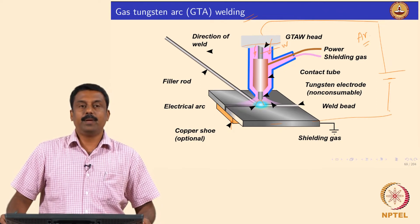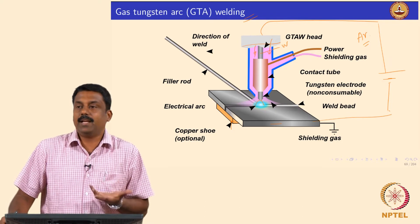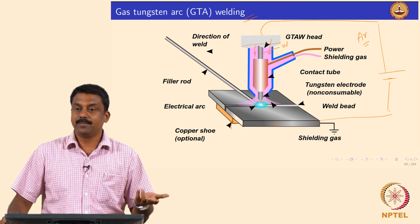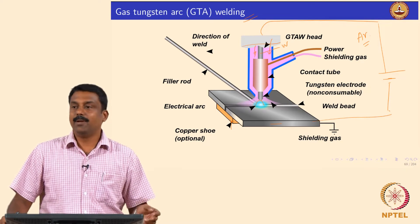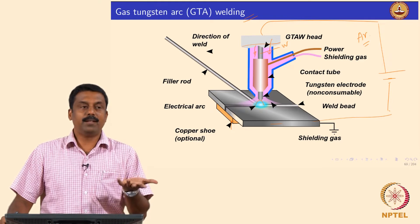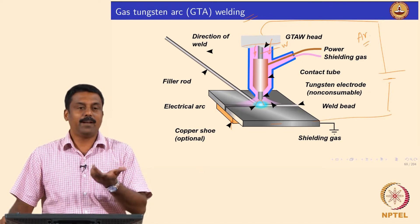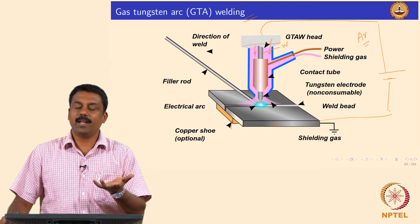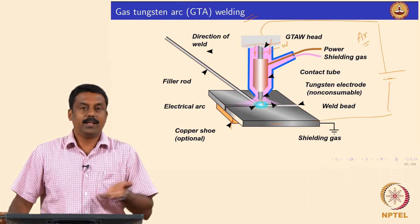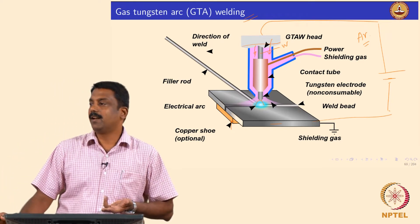The process characteristics are all determined by the shielding gas, and the current and voltage. Heat generation is governed by the electric field E, and the shielding gas determines the number of electrons and ions present — that is the electric conductivity of the arc. The two important factors we can influence are: the number density of electrons and ions, determined by temperature and shielding gas; and the electric field E that we apply. By changing these two, we can change the heat generation in the arc.